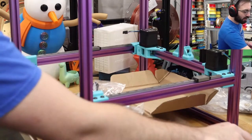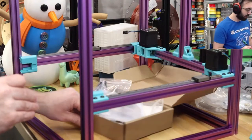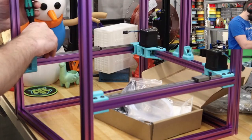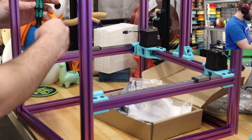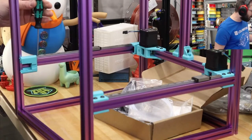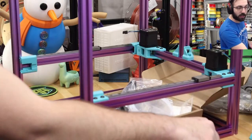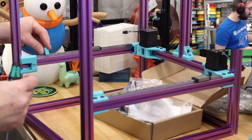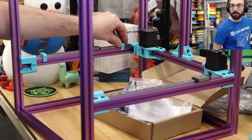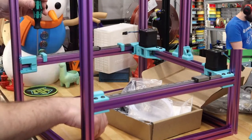That being said, a lot of projects are developed so you can print them on a smaller printer. And a lot of pieces print better on a smaller printer. If you're trying to print something really big in ABS, unless you have a really good ABS printer setup with a heated chamber, good build plate adhesion, etc., you might not even be able to utilize your full print volume. So keep that in mind too.